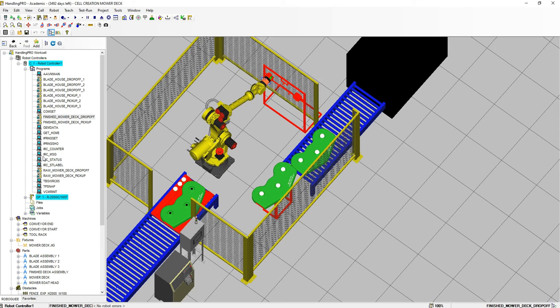This is the pickup and placement. If you have an actual device, this is where you have the sensors. Because we don't have the sensors and digital ins/digital outs hooked up on the actual end-of-arm tooling, this is RoboGuide — so we have to add simulations to actually pick it up and place it. In real life, you would have a digital in, digital out, or robot in/robot out — some sort of sensor sensing that it has a grip. That's the difference between real life and the simulation program.